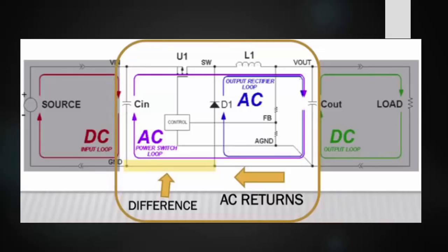It's important to note that there are two separate AC power paths in a non-isolated loop. These need to be separated and isolated from one another. The data sheets from manufacturers will guide you in different isolation methods for these — ensure you know that these are not one AC loop, but two separate loops that must be treated independently.